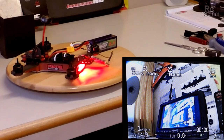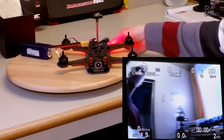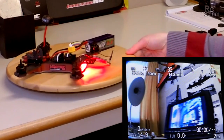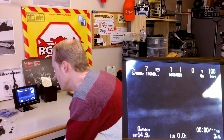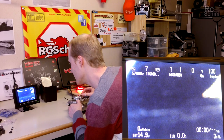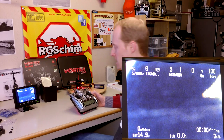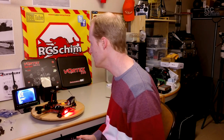This is so nerdy, but that's what we want. That was the sound of victory! So what do we see on the OSD? It gives me an RSSI reading, which I love to see — really good. I see that I'm in acro mode, I'm disarmed, the channel reading — the mode switch works, which is really cool. I copied this model from another quad with CleanFlight on it so it should be about the same.